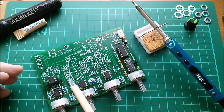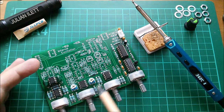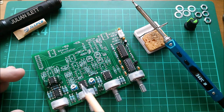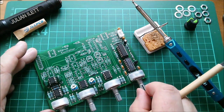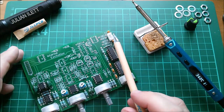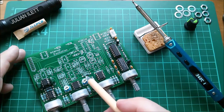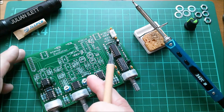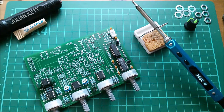I think that's everything needed to get the oscillator — which we have heard since I fired it up when I first started assembling this — and now also the noise generator. The oscillator level pot is this one, noise generator level pot is that one, plus frequency and shape controls. I need plus and minus 12V power and I just need to pick the audio off here and feed it into my active speaker. Let's set up power and the amplifier.